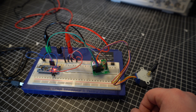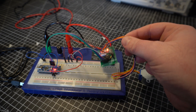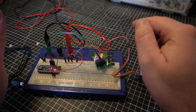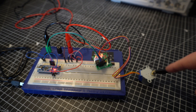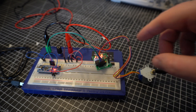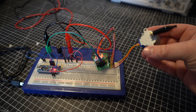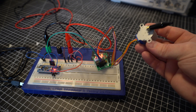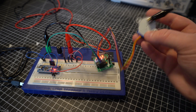One other thing to note: you'll see the pulses coming out with the LEDs about every hundredth of a second or so - that sets how fast the motor will spin. How quickly you pulse each of those pins tells you how fast the motor spins, but there's also a limit. You can only pulse it so fast - I think this motor's max frequency it'll accept is like 100 Hz, a hundred times a second. That's pretty quick but there's obviously a limitation with how fast this little motor can go. Not a hugely powerful little thing but perfect for this use case.